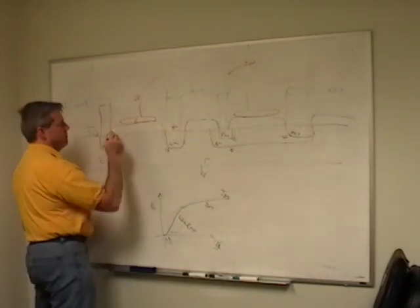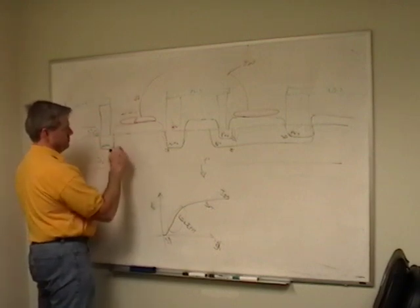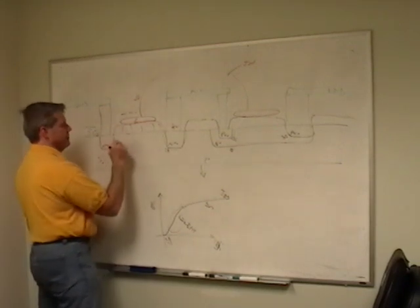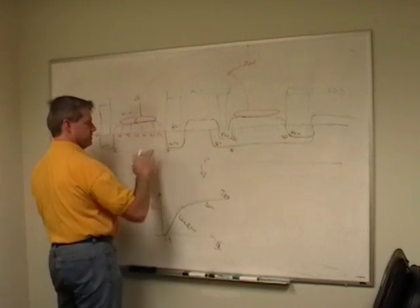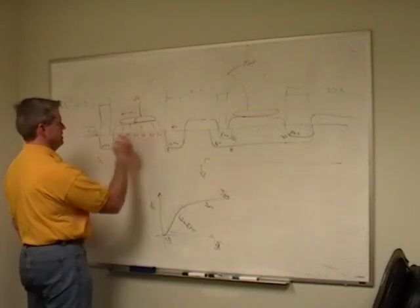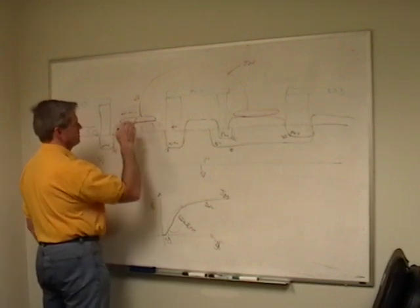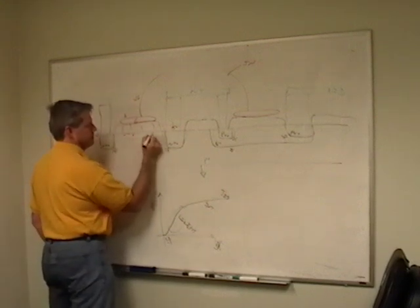So now if I put a negative voltage on this, well, I am causing a field here through this gate oxide, FOX field oxide, to happen. And what it's doing is it's pulling holes up here. All these holes that might be running around in here want to come up here, and you're really horribly reverse biasing this. Not going to conduct. So as I start to put a positive voltage on this, we'll put a little bit on here. Well, that's going to pull a couple little electrons up here.